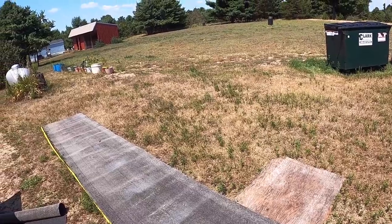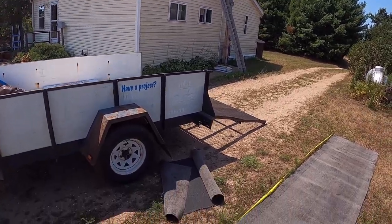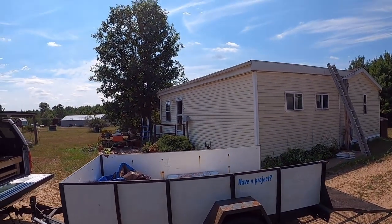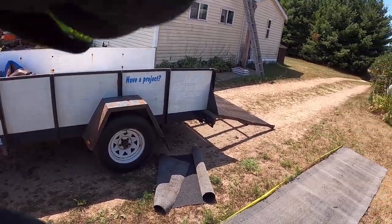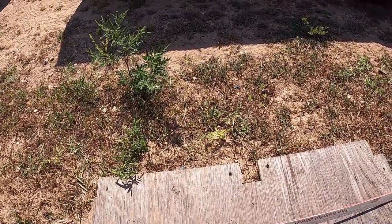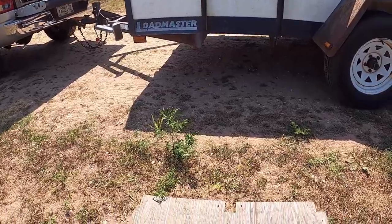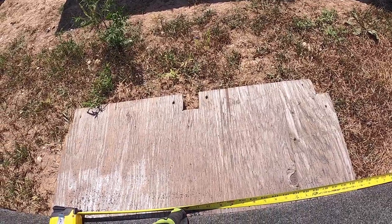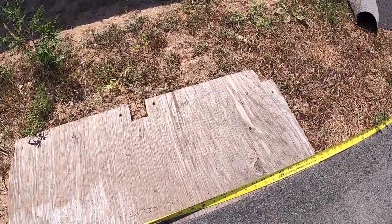All right, guys, so I just put a new blade in the utility knife here. We're going to cut this. I just got it laid out. Roll it upside down, preferably. If you roll it upside down, it'll actually help you out because you're not fighting against the grain of the roofing. Now what you want to do is take this. This should be pretty much level. Take it with 15, and it doesn't have to be exact because we're going to underlayer it underneath something else, but it looks pretty good like that. You take your utility blade.